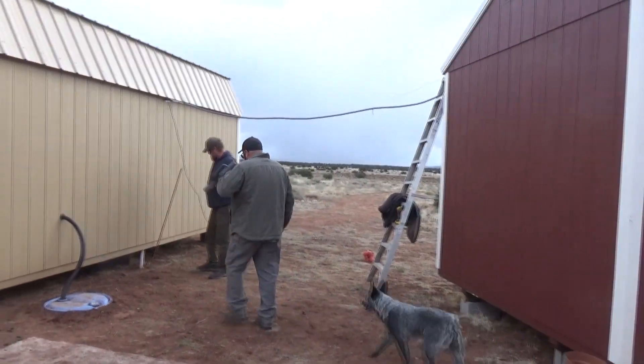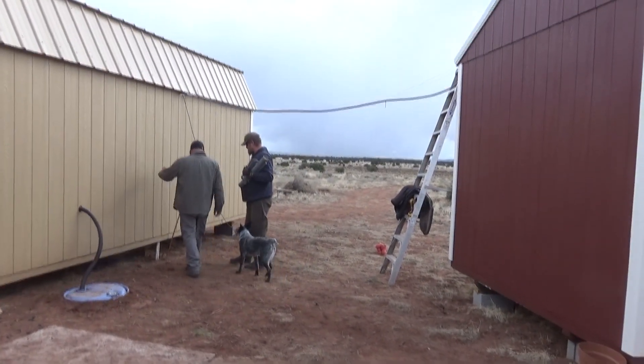Today we're going to finish off the walls — we're going to finish the rear wall as well as the front wall. The front wall needs to have a double box mounted for the light switch and the GFCI outlet. That's going to be a double wall box, plus a single outlet down here where the electricity comes into the unit from the rear of the building and gets grounded just below that.